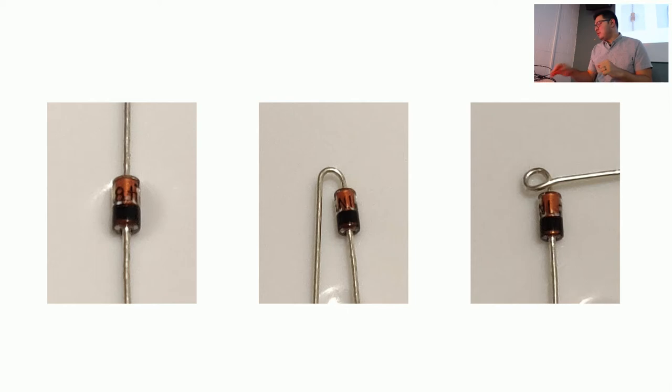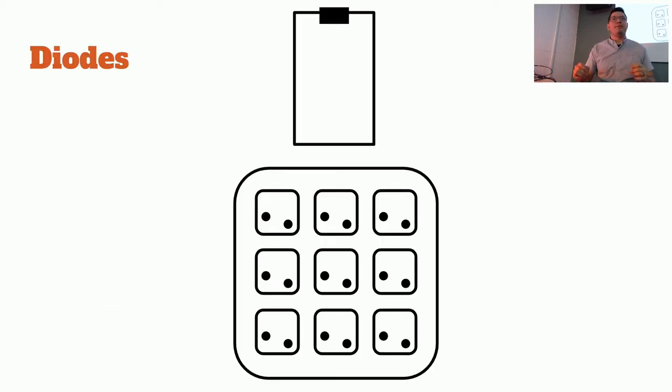Okay. Cool. So the next step, let's actually put these on. Ideally, follow this method to help with organizing where the wires are going to go. So take one of your looped diodes, loop it over one of those switch posts, and then take the other side and bend it across.